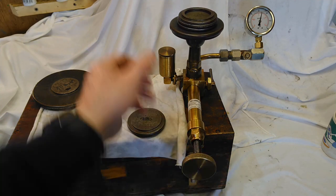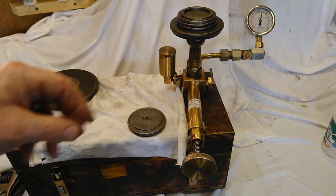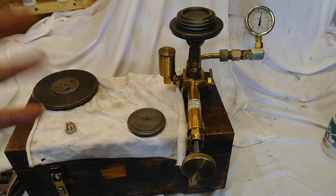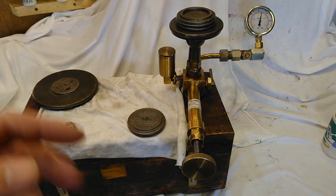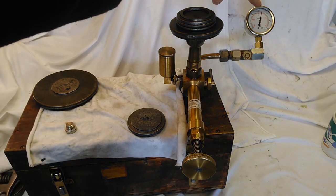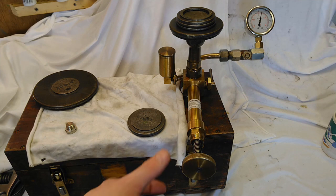Bring that up a bit further. Spin it round, it settles down to 17 psi, so it's a steady 2 over, isn't it? And as you can see here, possibly see here, the bubble there, it's filled with silicone fluid, and that's the bubble at the top where the air is, because you've got to give it room to expand with pressures and temperatures.